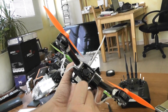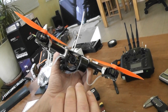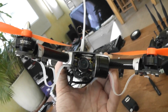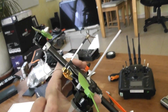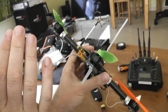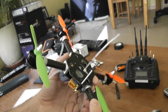The FPV camera standalone is good, not the best one. I found the light illumination sensitivity could be a little bit better. You will see in my outdoors video when I go close to tree parts and lighted places, the transition is not fantastic. But it's not a bad camera at all. The video transmitter is okay, but maybe another choice of video transmitter would be better — I'm not a great fan of BOSCAM. You can have a little bit of noise on the image, and it's not coming from the motors, it's coming from the electronics of the BOSCAM. I find it a little bit noisy intrinsically.